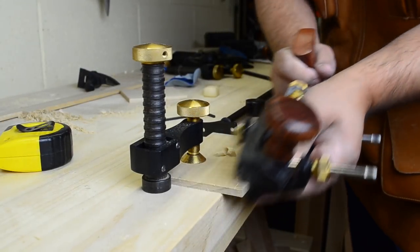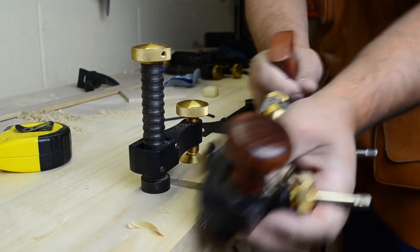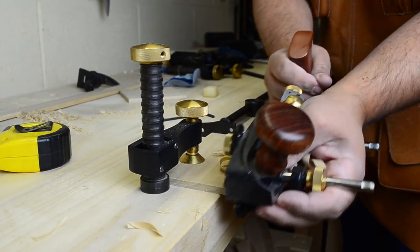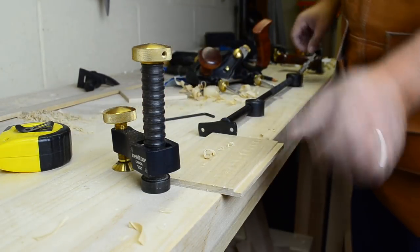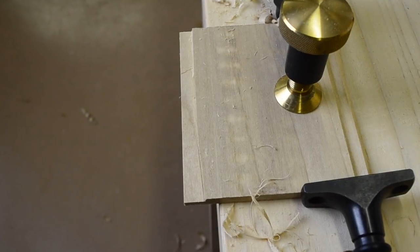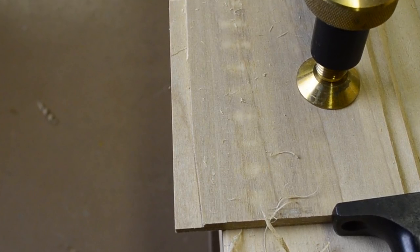Both the front and back faces require rabbets for the sides to sit in for assembly. Now I can cut them on the table saw but my rabbeting plane does the job with far less noise and even less sawdust. Perhaps the number one key to successful square shoulders is pushing the fence and body of the plane against the workpiece's edge while only using the plane's tote to push it forward. It only takes a few passes until the depth stop indicates it's at the final depth, and then it's time to flip the piece to cut a rabbet on the other side. Unfortunately on this piece I didn't follow my own advice — you can notice there's a little bit of an angle to the rabbet at the entry point. Again, pushing on the fence and the body will give you the best results.